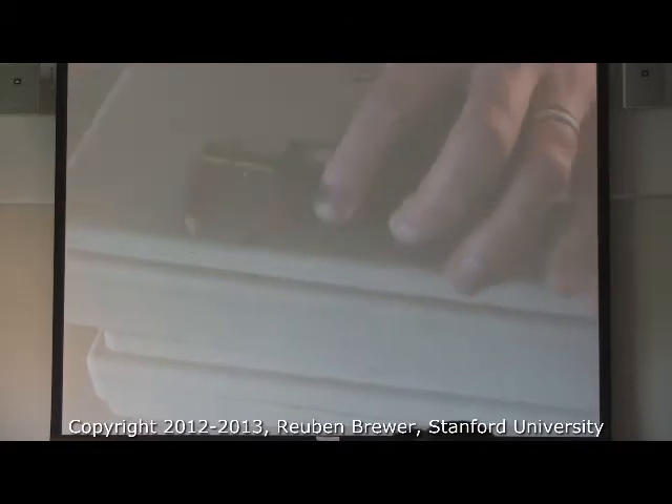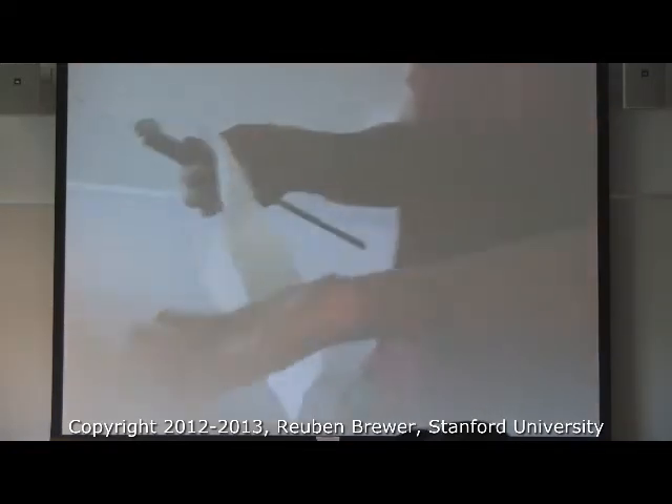The precision on digital calipers you'll get at OSH or McMaster is about one-thousandth of an inch, or 0.0254 millimeters. A lot of dust is on that scale or bigger. So if I hack on this and there's dust, all my measurements will be incorrect. You don't want to use your fingers because you have stuff on your fingers too. Also, don't use paper towels — the small fibers from a paper towel will be left on your calipers and then you're measuring small fibers instead of your object.